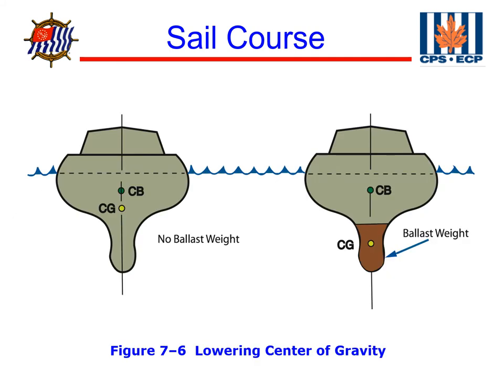Hull design factors affect the stability of the boat. A deep drafted boat with ballast located low in the hull will result in a stiffer boat that won't rock around as much. Design factors that affect hull stability are: size, beam, draft, weight, hull form, and ballast. Moving from a 40-foot boat to a 50-foot boat, the righting moment doubles for each degree of heel. Increasing the beam increases the length of the righting arm, but also increases the wetted surface underwater, which increases hull friction resistance and slows the boat down. Deep drafted boats carry the ballast lower, which increases the righting arm and allows for higher aspect sails and better upwind performance.